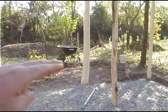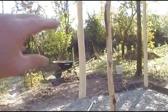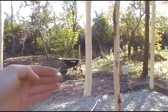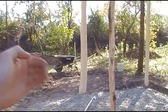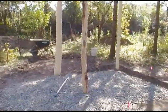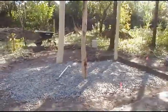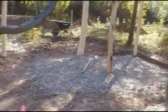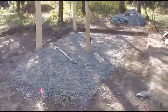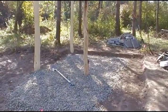The southern wall will only be about three or four feet high, and then the rest of it will all be insulated windows across the entire length, with a greenhouse on the outside and a trombe wall which will be accumulating heat and pumping it through air ducts. So hopefully nearly passively — obviously there's wood heat, but there'll be no electric moving all this stuff along. This should be a cabin that, although not incredibly insulative, should perform really well thermally by banking and buffering all the heat generated by the sun and by the wood stove.